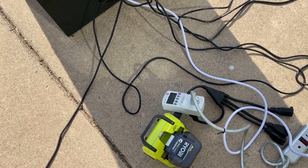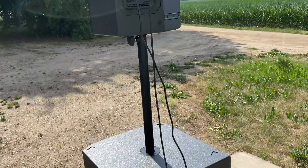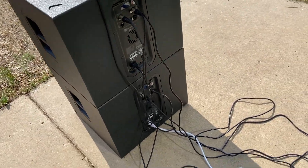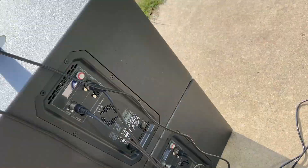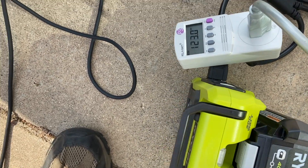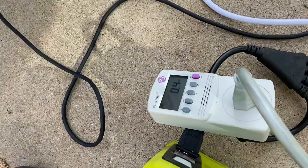And that's it — it overdrew the inverter. The inverter shut down. It had more draw with the dual subs and this was wide open, pretty much — it was very, very loud. Okay, version two: we just turned the volume down, going from what would be considered high school dance volume to less than that. On the first try at that higher volume, it was drawing over 300 watts of power for that instant. Let's switch back to volts and power up.